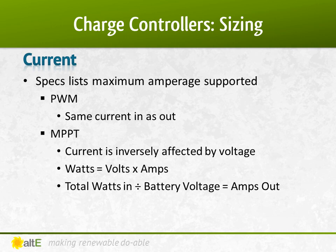Charge controllers are also rated by the current range they are able to support. PWM charge controllers just pass the power through from the panels to the battery bank, so there is no adjustment — current in equals current out. You would select the charge controller based on the ISC, or short circuit current, of the solar array. MPPT charge controllers are rated by their current output, not their input. If you are inputting 60 volts and outputting 24 volts, the voltage is going to drop. Because power, or watts, equals volts times amps, to keep power constant, anything I do to the volts, I have to do the opposite to the amps. So when the volts drop on the output of the charge controller, the amps will increase. To figure out what the output will be, take the total watts of the solar array and divide it by the voltage of the battery bank. For instance, a thousand watts into a charge controller connected to a 24-volt battery bank will output 41 amps — so I need to find a charge controller that can output at least 41 amps, like the TriStar MPPT 45.